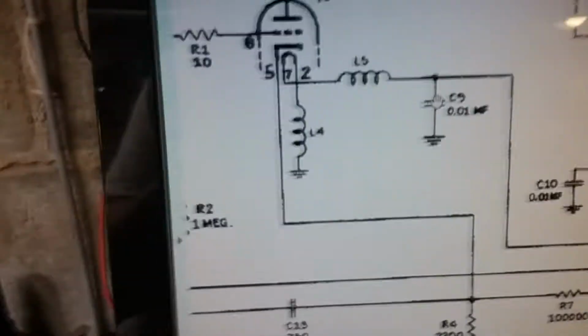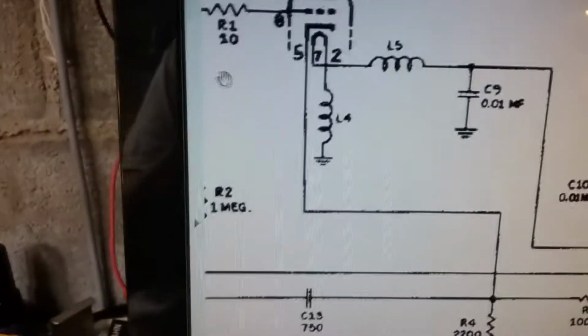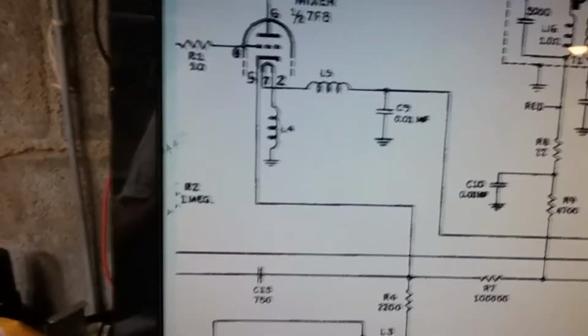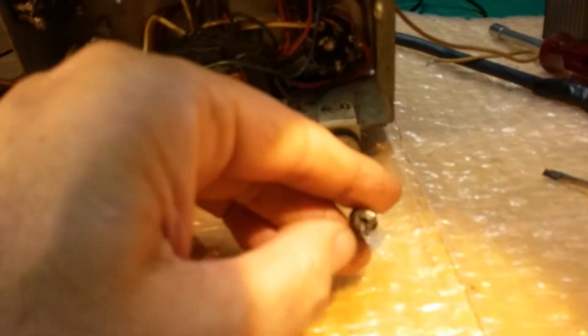That's why on a schematic, when you're looking at a capacitor, it always shows them as two lines, because that's what they really are. But now the two lines are really long. They go from way over here to way over there, and then way back, with paper in between. And of course, they're not going to make capacitors that are 2 feet long and try to stick them in the radio, so you roll them up. They roll them up like a donut, like a Swiss roll. Little Debbie Swiss rolls, that's what they remind me of. And they roll them up, and one lead connects on the inside, and the other lead connects on the outside.